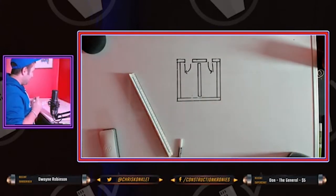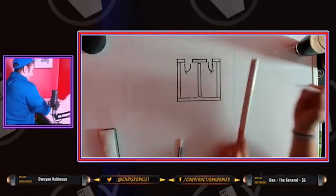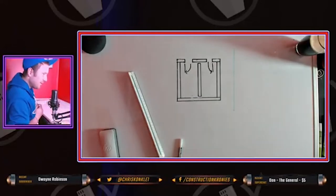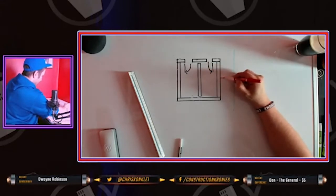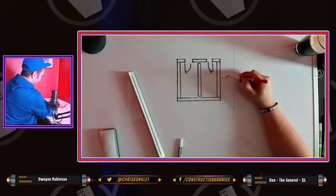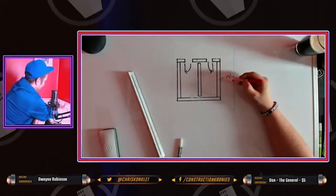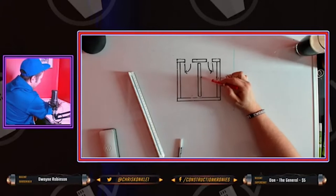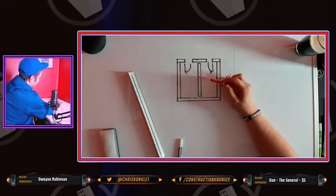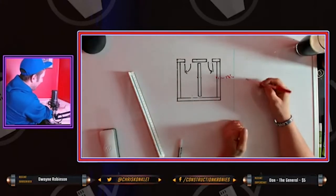When you're looking at the drawings, they're gonna give you a grid line somewhere — let's say it's like here. They're gonna give you a measurement from here to here, say two foot three-quarter inch. There are different places for this. They can go to center of wall or inside of wall. Sometimes it'll be like center to inside, or center to center, or center to outside. You never know. Just follow the hash marks and then you need to add and subtract.